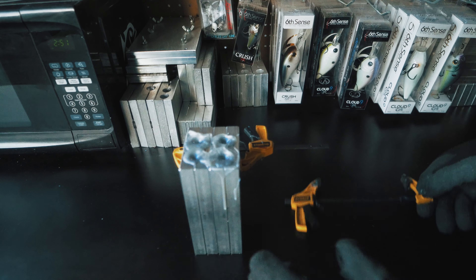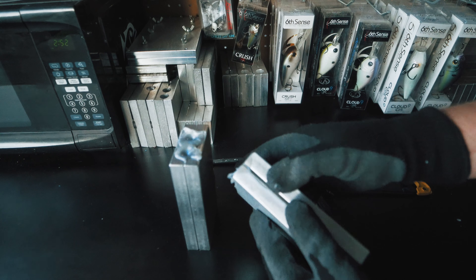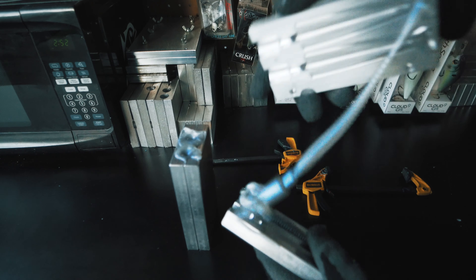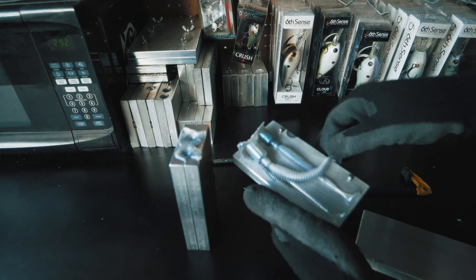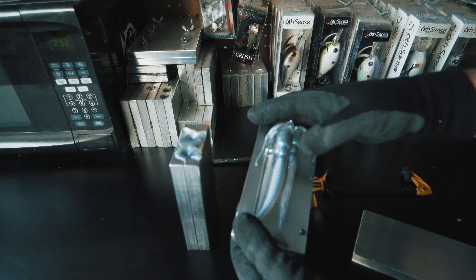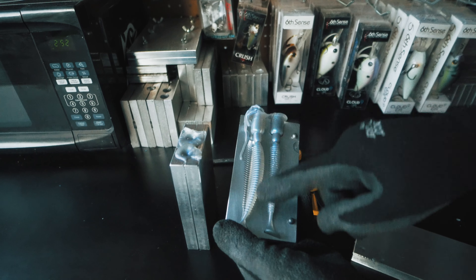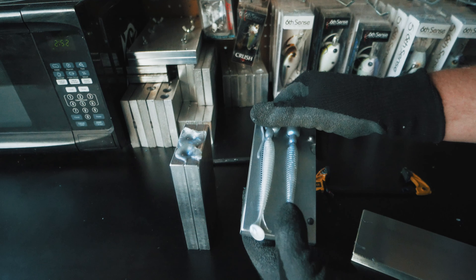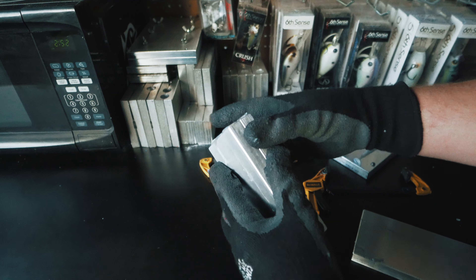I poured these a little bit hotter so I'm hoping that the mold cavities fill out a little bit better than some of the ones I've done already. I think all the baits that I've made are definitely going to catch fish - some of them didn't turn out as well as I would have liked. I think you've got to just pour this mold a little bit hotter than some of your other ones. The laminate works really really well, so I don't think you're going to have any issues by pouring it a little bit too hot. Pretty much it - we got our last set of four going. Final round of swim baits - the brand new Quake and Shad.